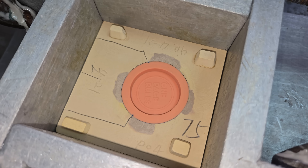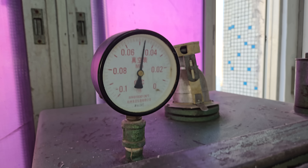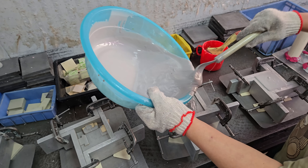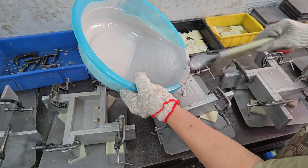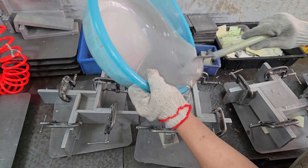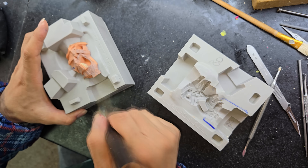The clay and plaster blocks get framed up, and this area above the plaster, clay, and masters will be the other half of the mold. Gray liquid silicone is mixed up and poured over the top. Only a thin layer is added at first because a vacuum chamber is used to pump out the air bubbles — it's important that the material in direct contact with the masters doesn't have any imperfections. After vacuuming, a much thicker layer of silicone is added to form the bulk of the block. When it cures, this gray silicone has a hardness similar to rubber, with less give than the clear silicone used earlier.